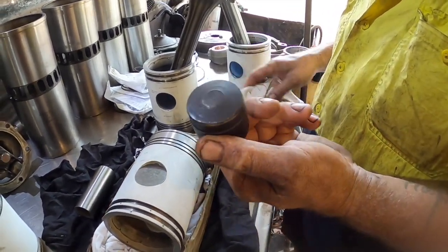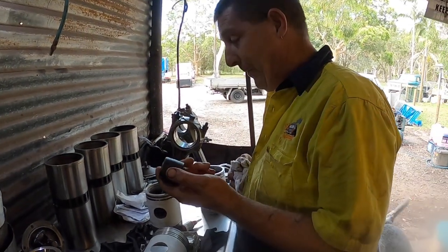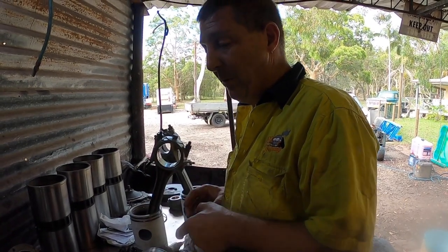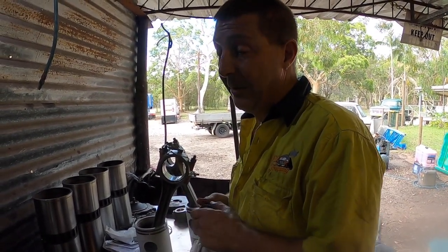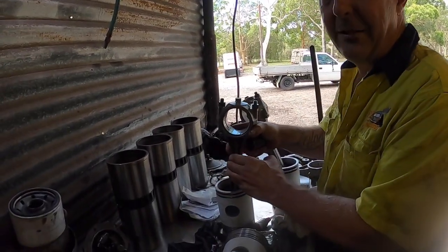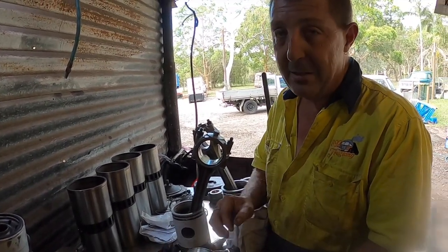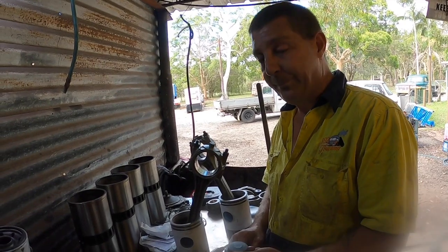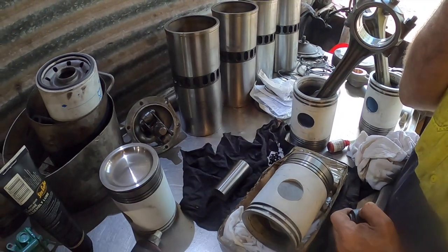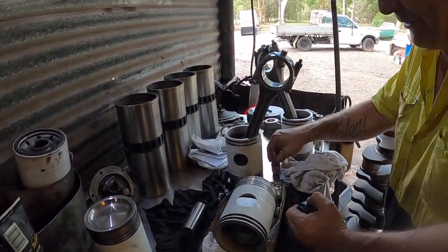There are different tools. This one is for a trunk 71, there's one for a 53, and one for a 92. They're all different. The 92 one is the same as the 71 crosshead. The crosshead is the style where the conrod actually bolts to the piston pin, the gudgeon pin. The little retainer's a little bit smaller. I'll dig some out for you so we can look. It'll give you an insight into what that looks like.